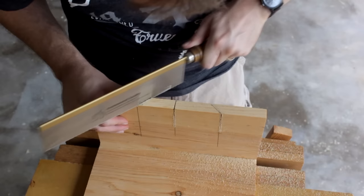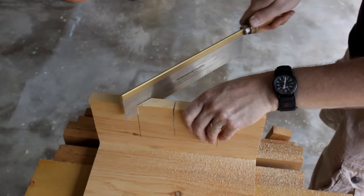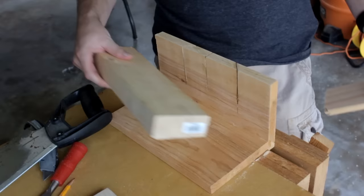The reason I left the side of my miter box so tall is so that it can accommodate different widths of board. I am not putting a second side on, and traditionally that second side would be used to help keep your saw straight on in the cut. But it gets tricky when your board width is wider than the box side wall. However, I don't do just carpentry — I am a woodworker and so I am dealing with all sorts of different types of materials.